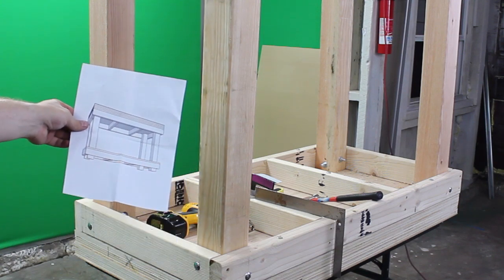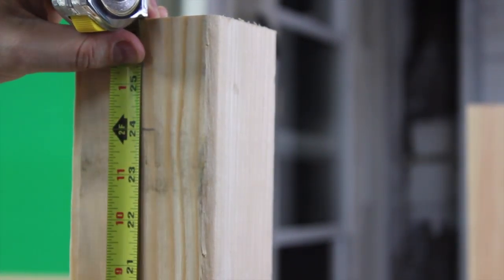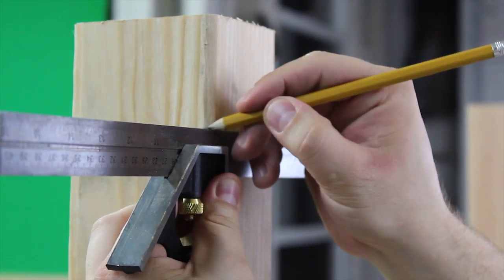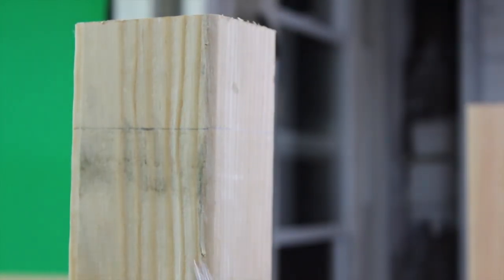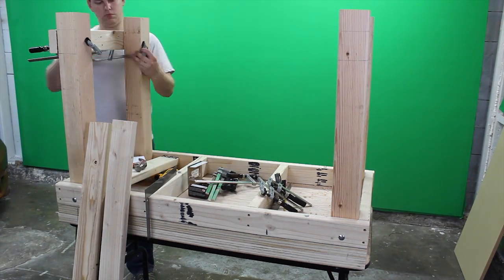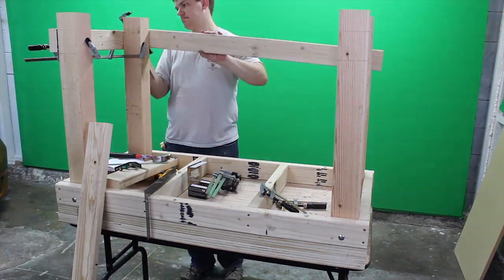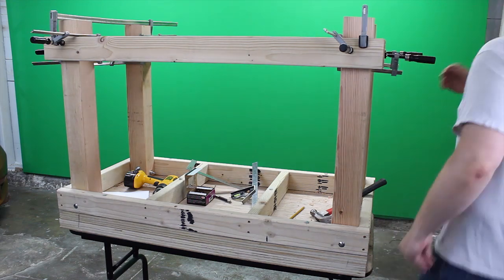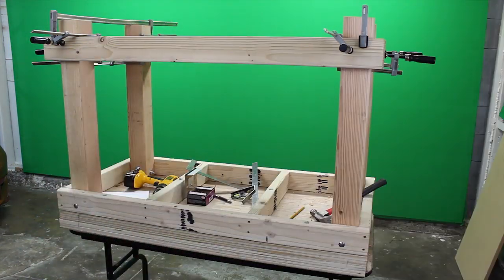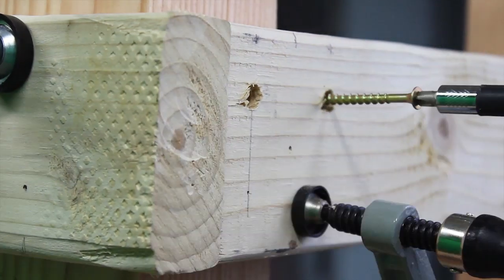Looking at the plans, that's how it's supposed to look at least right now. Now let's start getting that lower shelf in line. I measured up 24 inches — since the top wasn't totally even or level, taking the measurement from the bottom up guarantees my measurements are 100% on. We're going to rely on our clamps to hold the stuff up. Grab all your leg material and just clamp it up there. We're going to start leveling it to make sure everything is 24 inches from the top to the bottom before we screw them together. We're going to screw them, not use carriage bolts on the bottom — the bottom will be supported by the MDF.